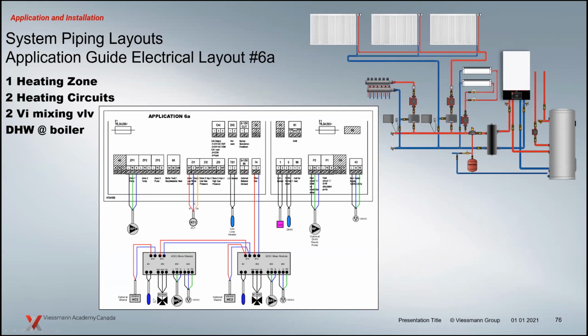They've got the Vitotrols connected to the plus bus directly on there. Then I'm daisy chaining over to the other mixing valve block, and another Vitotrol is being added. And then I'm going from this control back to the 74 plus bus. So it's possible that communication just continues on from one control to another.